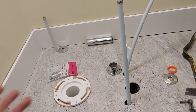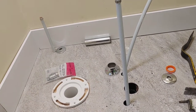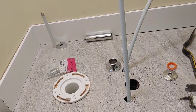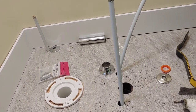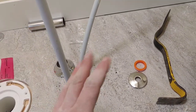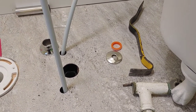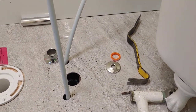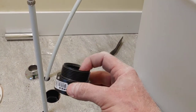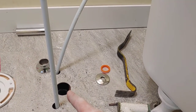Now, this reno all started because of a leak, so there's a little bit of damage to the kitchen ceiling anyway. So I'm down there now, I'm hacking. What I'm gonna do is trim this back from underneath and start fresh with some inch and a half stuff. And then that will allow me to get a proper inch and a half one of these, and then my new plumbing will slip in there. I mean, this should have taken 2 minutes.